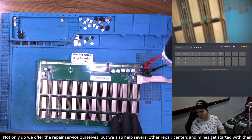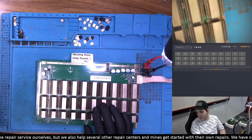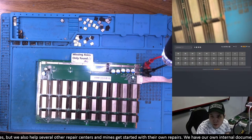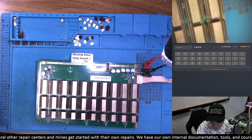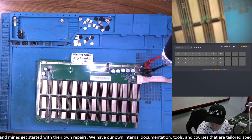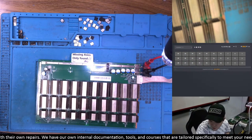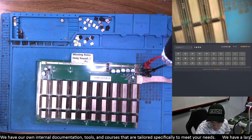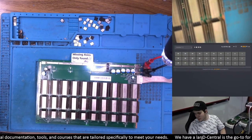This customer sent us a batch — he had both types in his units. The larger heat sinks would be better, and the thinner ones were more delaminated. It's obviously more trouble when machines are delaminated. As I've mentioned, one of the biggest issues is not the actual repair but getting a good adhesion of the heat sinks on top of the chips. We do have a technique to retain the chips. At the end of the day it's not an issue, but it is very time consuming to fix all those delaminated chips, re-solder the heat sinks back, and finally get to the repair. We always enjoy when we get a board where we know the heat sinks are going to be tough.